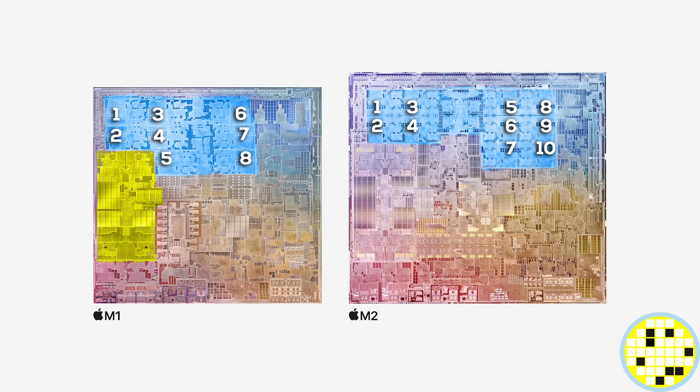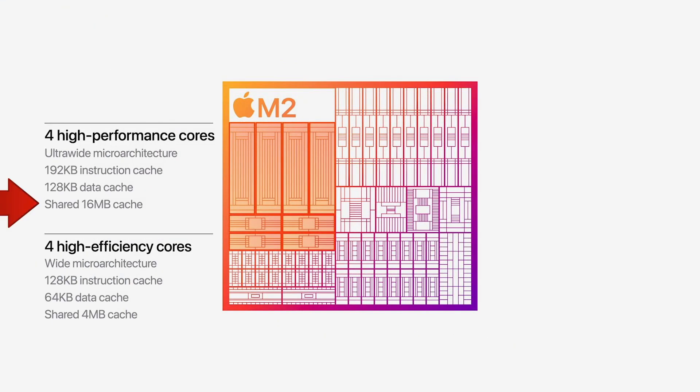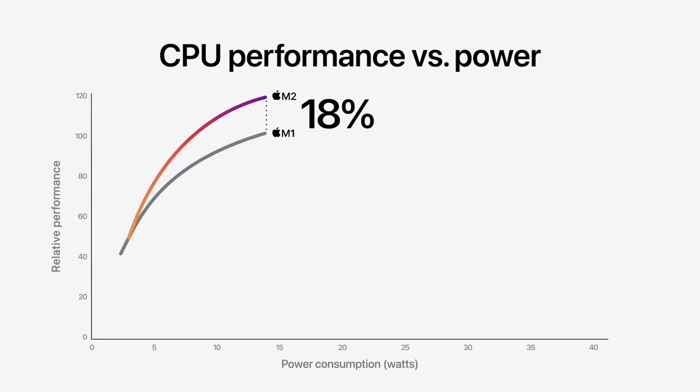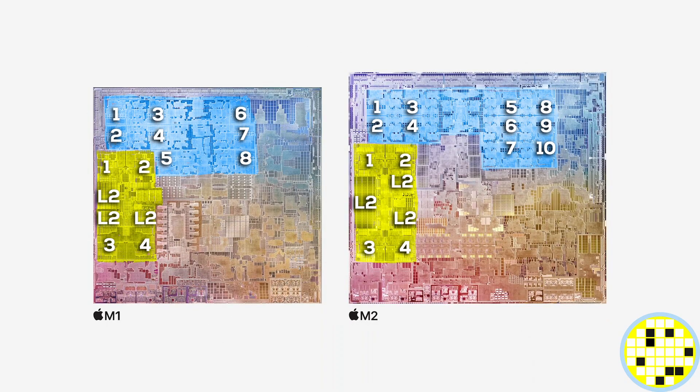Next are the performance cores of the CPU. If you compare the P-cores on the M1 die, we can clearly see the four individual CPU cores and the shared L2 cache in between. On the M2, not a lot has changed here, but the larger L2 cache is clearly visible. With M2, Apple increased the L2 cache size to 16MB from 12 in the M1. Apple also claims an 18% performance uplift in multi-threaded CPU workloads, but this number also includes the E-cores. Aside from the larger L2 cache, the P-cores look very similar to the cores on the M1. I expect Apple is using the Avalanche cores they introduced with the A15 design last year. We should see a slight IPC uplift and maybe some higher clock speeds due to the improved process node, but nothing groundbreaking like a new ARM V9 design.